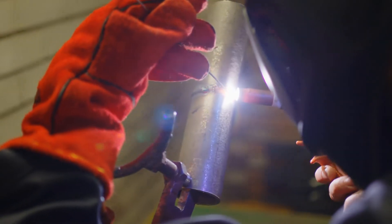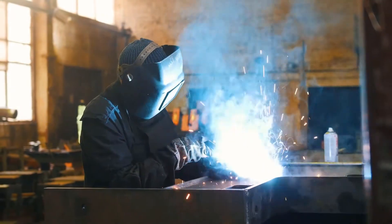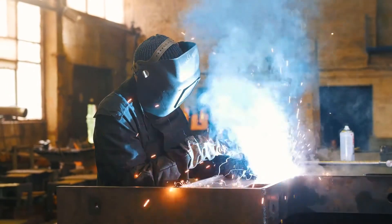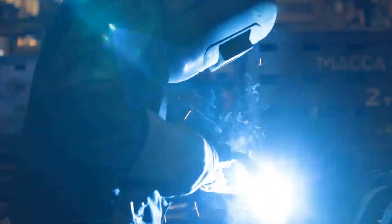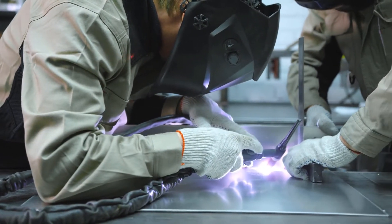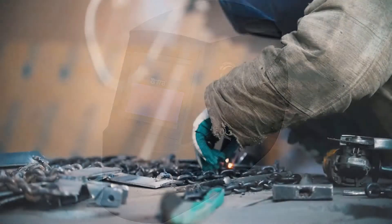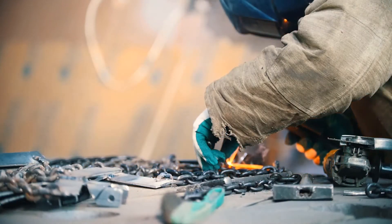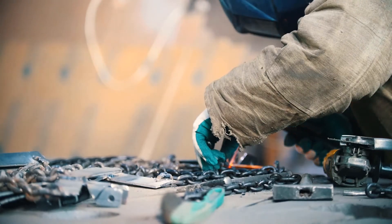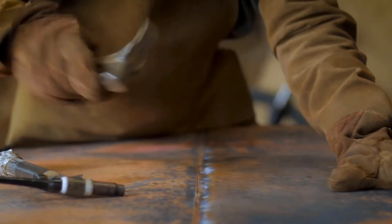This is a product for anyone looking for the best affordable welding helmet. It's a versatile helmet great for TIG, MIG, MMA, and arc applications, and also suitable for plasma cutting and grinding. It has an auto-darkening filter with 13 shades, and its fast reaction time ensures your eyes are well protected from welding glare. The four premium built-in sensors make it highly responsive to light from any type of welding. Magnifying lens compatibility is a unique feature for a welding helmet in this price range. Adjustable sensitivity is controlled via a knob on the side of the helmet, allowing you to adjust sensitivity and delay settings from 0.1 to 1 second, so you can personalize your mask.